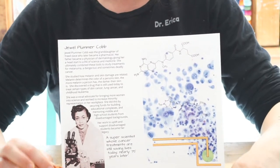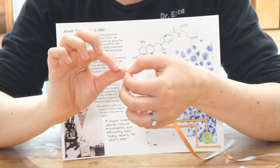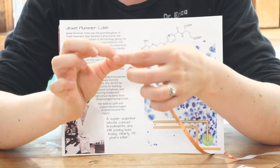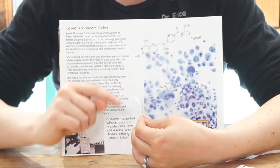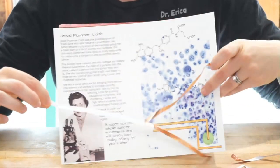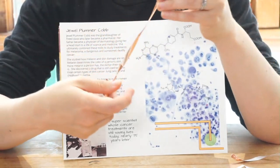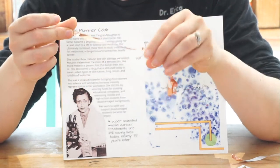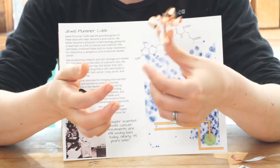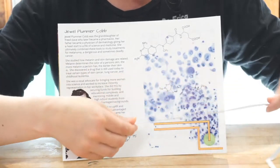If you're new to paper circuits, I want to teach you a few tricks. The first trick, and I have my own piece of copper tape for this today, is when you peel the copper tape, you've got to get your nail under there and make a little T like this. Once it's like this, we want to stick it down to the paper, because if we just pull it like this, it becomes totally unusable. It goes into a ringlet and you've got to do all this stuff to get it to flatten out, if you can. Sometimes you rip it and it gets not sticky. You don't want to deal with that. So whenever you use copper tape, you want to peel it and stick it down pretty immediately.